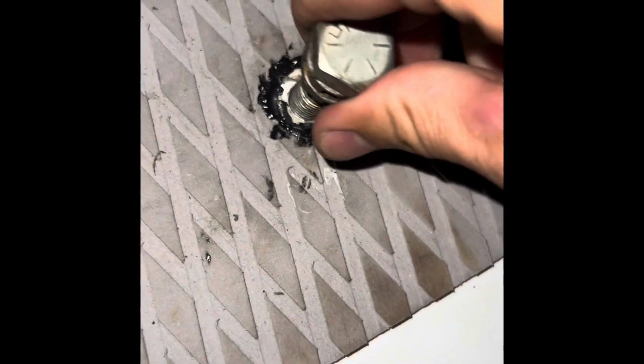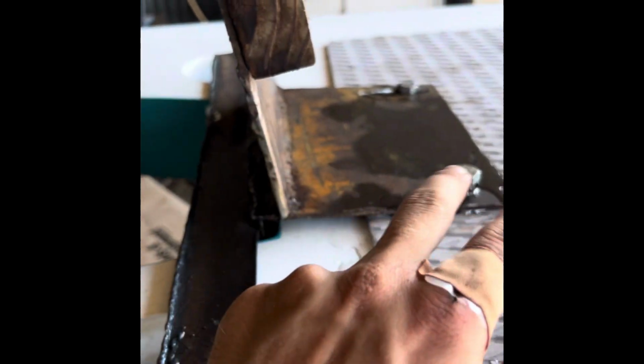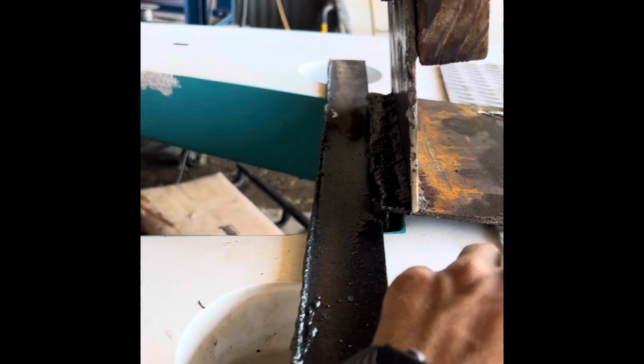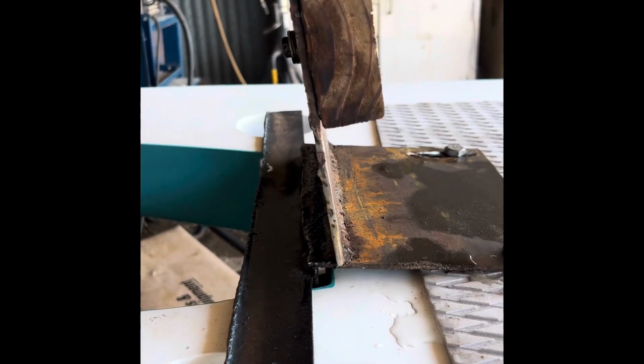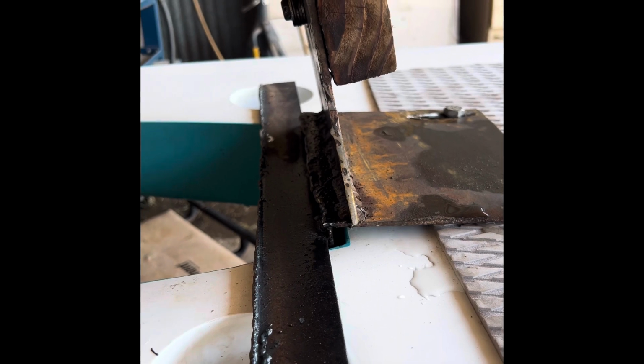So I can see why the transom they designed now has a piece where it kind of clamps the board, so it goes under and over. And so you can see here in my next design how I remedied that with my transom. So you can see here, I came back and we redid this piece. So I had it coming as a 90 and that was just it. It was just bolted, but it put too much leverage on those bolts and it ripped the mounts out.